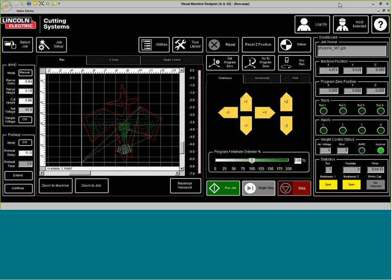But all that is the process of how you set up your plate marker for the VMD, go through the process of verifying the offset you have generated, generating that offset, and then adding plate marker to it with the different types of patterns into the design to help flex the possibilities of your table.